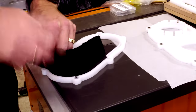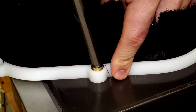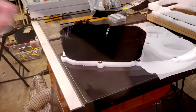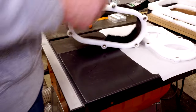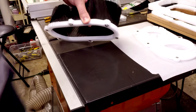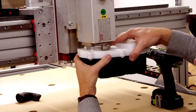Now it is just a matter of assembly. I first installed the brush — it is supposed to be a pressure fit, and the threaded inserts also push the walls of the groove inward to hold the brush in place. It was still slightly loose to me so I opted to add just a little glue for peace of mind. With the threaded inserts installed, M8 screws were put in place. You can see these protrude through the top of the piece, as these screws are what connect to the magnets in the top half of the dust shoe. With the magnets in the top walls, it was ready to mount to the CNC.